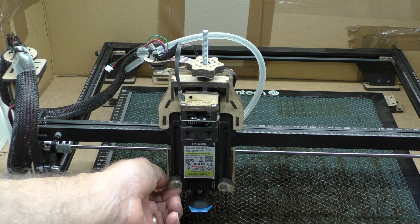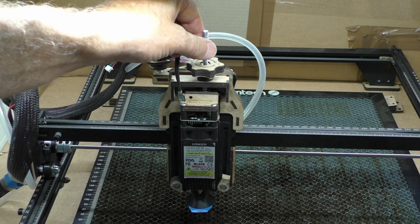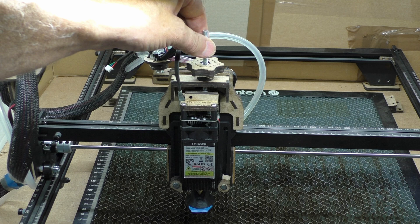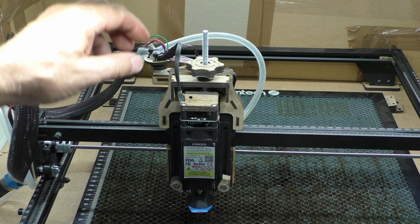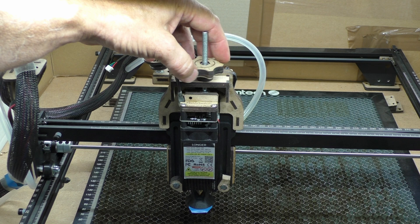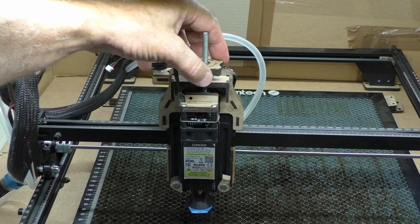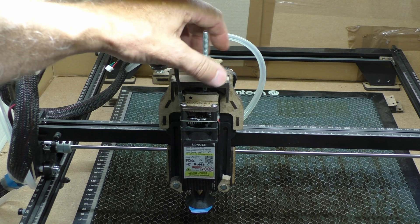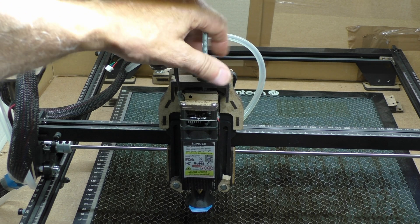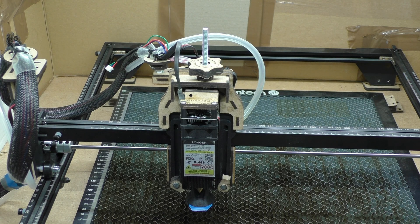Because you've got three points of contact now, when you're using the system you would release your bolts or thumb screws as you normally would, but now the top mechanism is stopping the laser from falling. One turn is about half a millimetre to three-quarters of a millimetre — so not a lot — making it a fine adjustment.